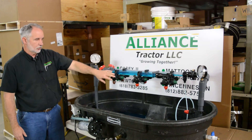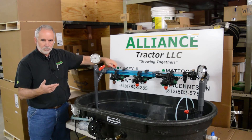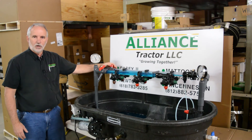These are identical spray nozzles and caps on both these booms. There's a longer delay starting up — remember, you're traveling 22 feet per second — and there's a longer shut off time when you're shutting the traditional cap off.